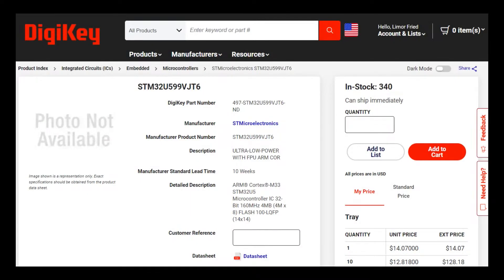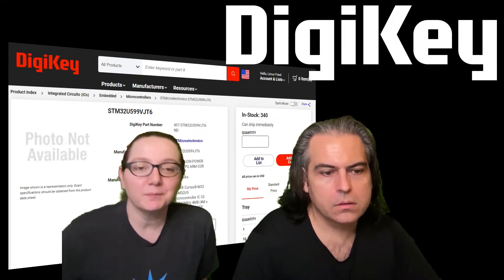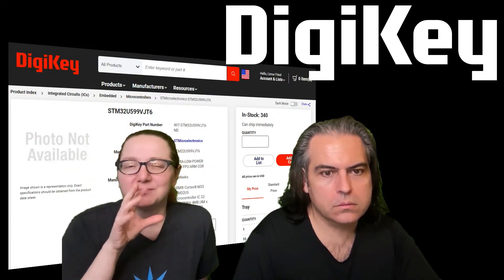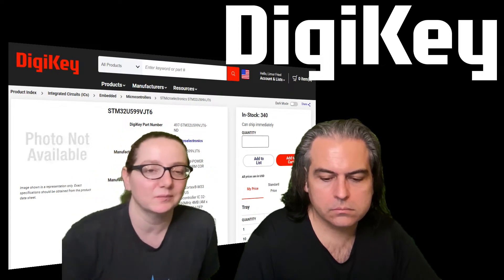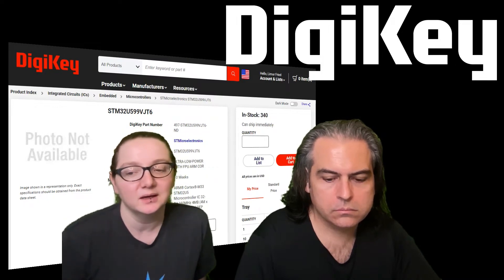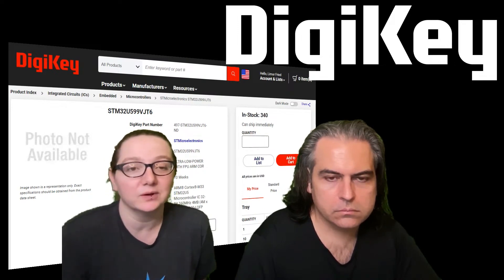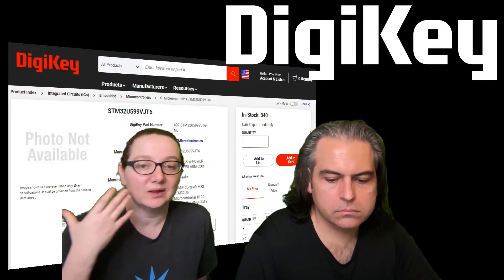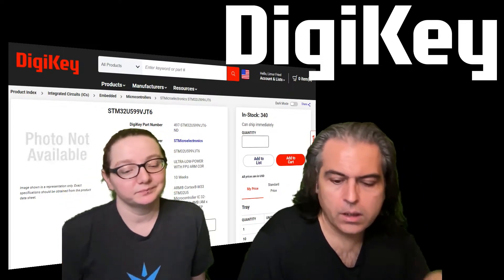Best of all, these chips are actually in stock and available to buy. They come in multiple packages — BGA, TQFP 64, 100, and 144 pin — so pick the smallest you can get away with. I love that they have TQFP because nice fancy chips don't always come outside of BGA. If you don't need external SRAM and you're using DSI, you might be able to get away with a four-layer board with full graphics display — where you might have previously reached for a Linux microprocessor, a microcontroller may now do the job.